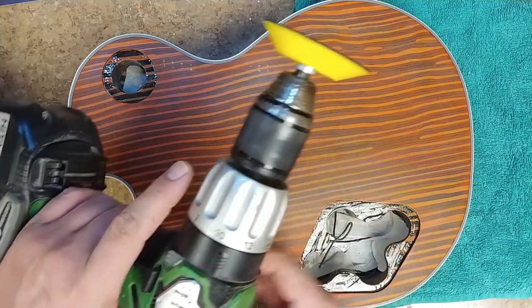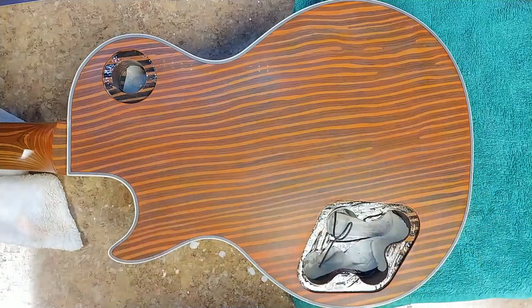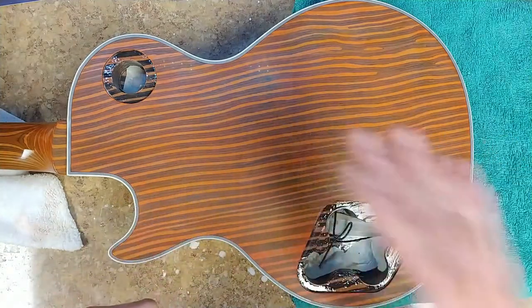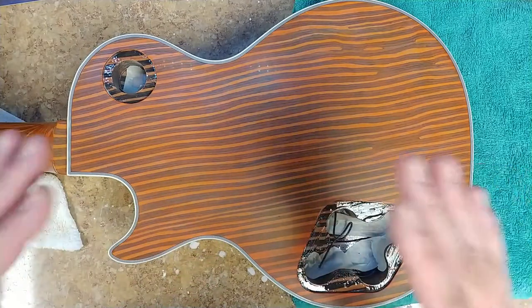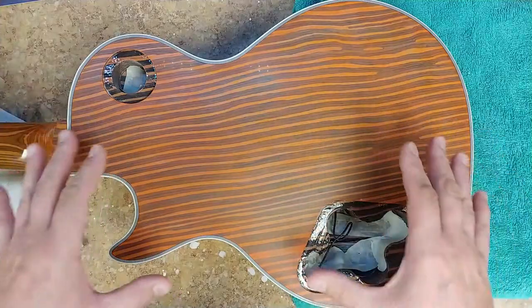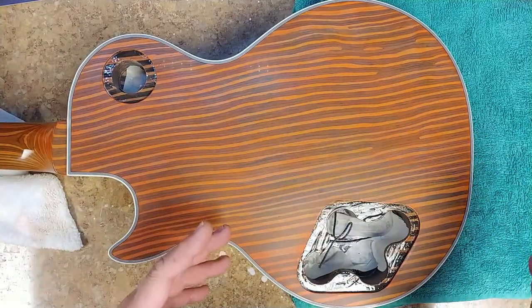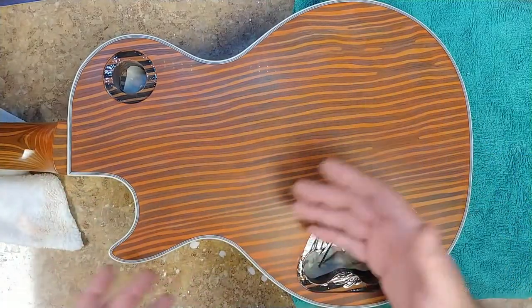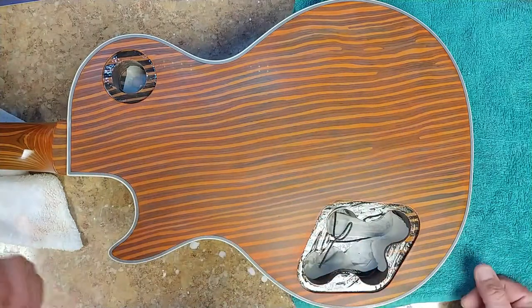it really takes off. That's going to give me the power that I need to let the cutting creams and the pad do their job. If you don't have the right tools, it's going to mess up. So I want to try this. I'm using the back of this guitar, so if it's going to mess up, at least I can refinish the back of the guitar without having problems with the rest of the guitar. That's not a big deal to me. I could fix that real easily.